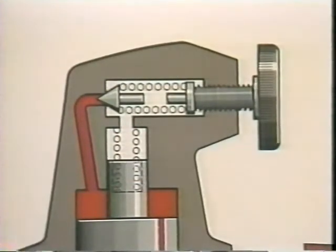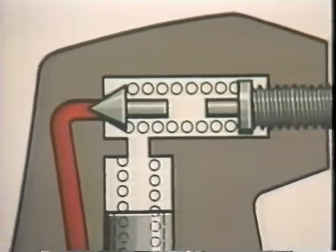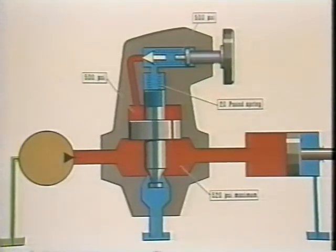All we have to do now is limit how high the pressure can go in the upper chamber. To do that, we put a small poppet with an adjustable spring in the top cover, and a passage connecting it to the chamber above the piston. If we set the poppet to open at 500 PSI, the pressure above the balanced piston will be limited to 500 PSI. With 500 PSI and our light spring holding it closed, the most pressure we can get in the bottom will be 520 PSI. To increase or decrease the pressure setting, we merely adjust the spring in the cover. Actually, three springs are available, giving us maximum pressure settings of 1,000, 2,000, or 3,000 PSI.